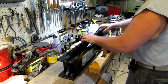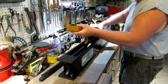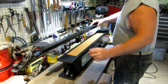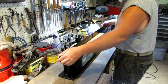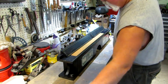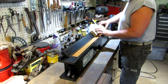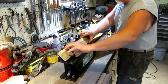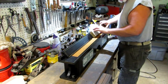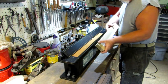To put it back together, it only goes one way. Take the number 33, drop it in, and then set up the fence for right or left-handed, whichever way you want. This is a right-handed setup right here. I can set it up for a 45 — just going to line up my bolts and lock it in. Now with it set up at a 45, I can use it to nick the corners off that piece of poplar that I just trued up. It did a nice job.